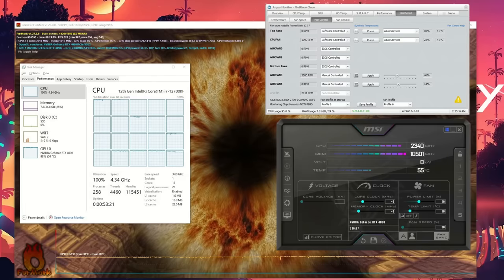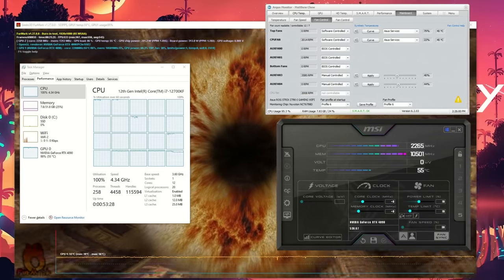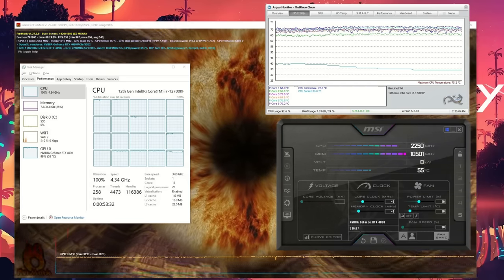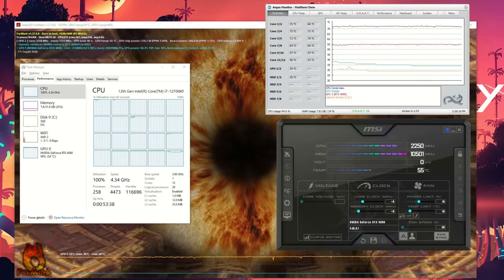As you can see, even with the GPU power limited, the coolant temperatures still get to 41 degrees with the fans at 80% when the system is under full load. Thankfully, I seldom fully load my computer and will not see such temperatures often. If it really does get bad, I will power limit my CPU as well.